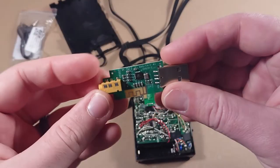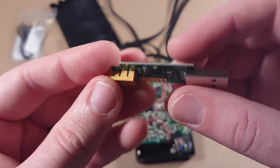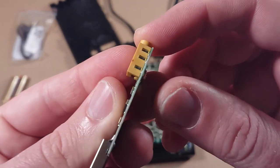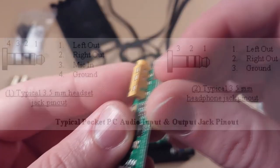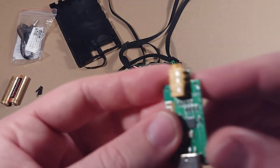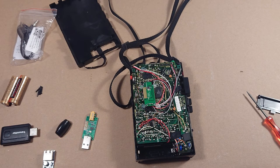Here's a different board I purchased — a bit more expensive, bought on eBay, probably a nicer board, but I ended up frying it and got the magic smoke. You'll desolder the headphone jack and USB port, then solder from the headphone jack points to the Walkman's headphone jack. Look up a headphone pin-out — you'll have left, right, ground, and microphone. I didn't wire the microphone since I don't plan on recording, but theoretically you could if you wanted to add more functionality.